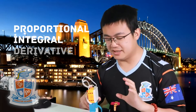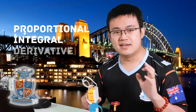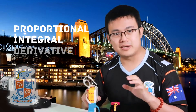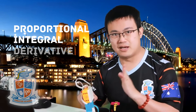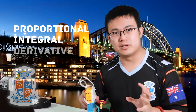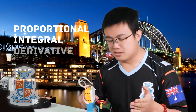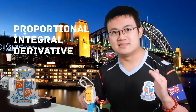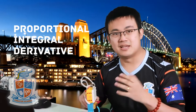Sometimes the proportional and integral are all you'll need for your robot. But what you'll find is there'll be a third problem: after you have corrected your movement, you will overcompensate, and then you'll have some wiggle. To smooth out those wiggling movements where your controller is overcompensating, you'll need to add something called a derivative - which is the D in PID. That smoothens out the compensation so that the movement is a lot better.